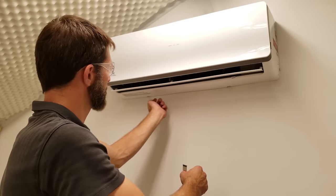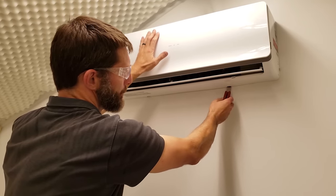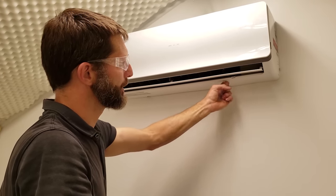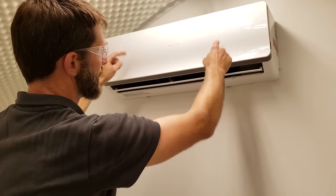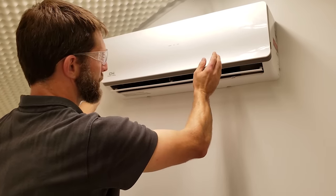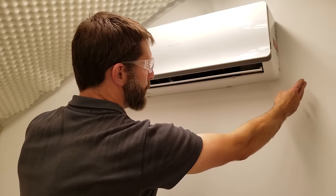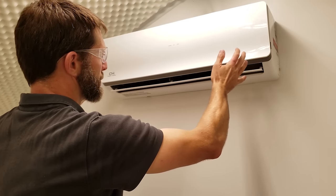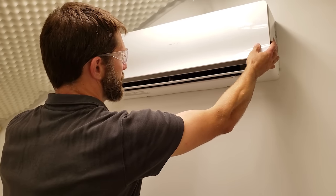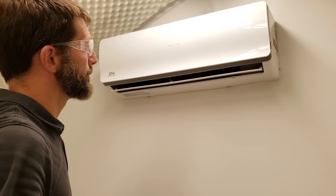If you ever have trouble with the snaps right here or want to take one off, I like to use a siding tool called a side swiper — you can come right up and pull that down. You can also use a clothes hanger or insulation hanger bent to get in there and pull it down. There are just two ledges up top and two little clips on the bottom that clip into the holes in the metal. You may have to shimmy it a little from side to side — make sure the bottom is pulled away from the wall slightly so it doesn't scrape. There's a little bit of play, but this one's all good and it's stuck in place. Let's continue on the installation on the outside.